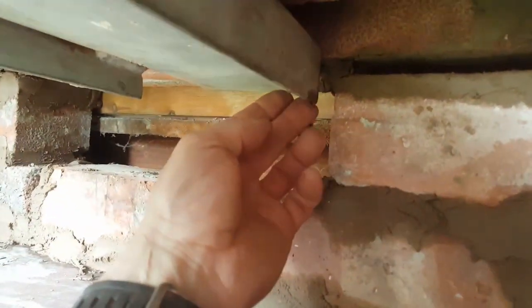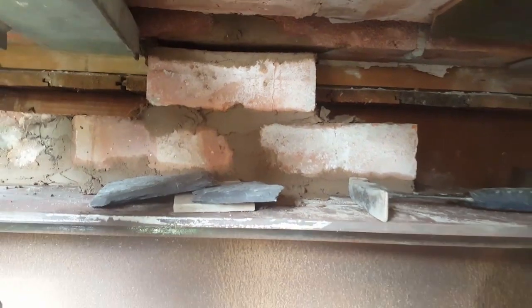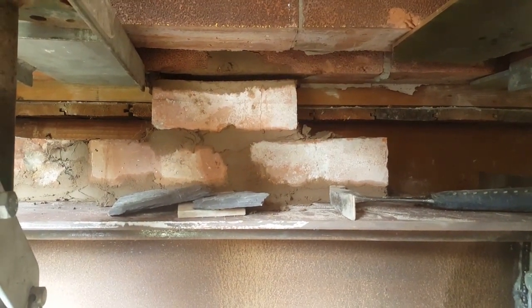Keep packing as much as you can. You can't put a brick under this section here — you've got to wait until that goes off, then take that out to get the brick in and slate it up. So that's how to pack above a lintel — above an RSJ. Be seeing you, be well.